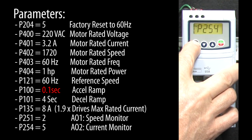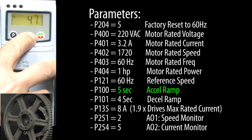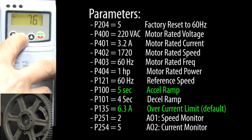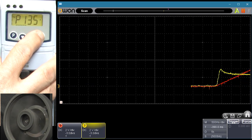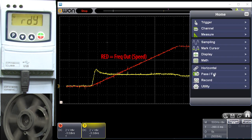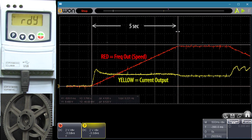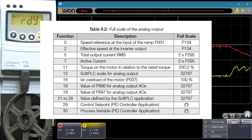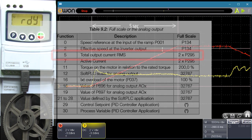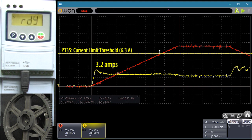I'm monitoring those on an inexpensive USB oscilloscope I bought on the internet. Before we change anything, let's get a baseline. Let's get the acceleration ramp back to a reasonable 5 seconds and put the overcurrent threshold back at the default value for this drive, which is 6.3 amps. I'll get the scope running and hit run on the drive, wait the 5 seconds for it to ramp up, give it a couple more seconds to settle out, and then hit stop. We can see the red frequency ramp is pretty much what we expected and the drive was able to get the motor up to speed in the 5 seconds we wanted. The analog current output is 0 to 10 volts where 10 volts is twice the drive's rated current of 4.2 amps — that's in the analog output table in the programming manual where parameter 295 is the drive's rated current. The current got up to around 3.2 amps, and we know from parameter 135 that the current overload threshold is set at 6.3 amps, so the 5-second ramp was easy for the drive to do.